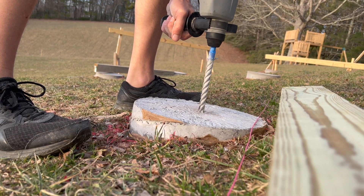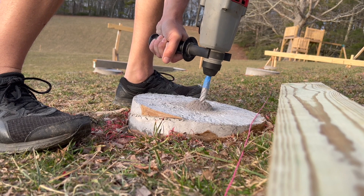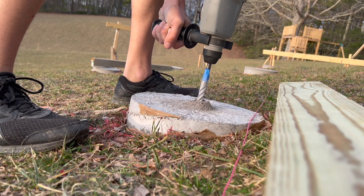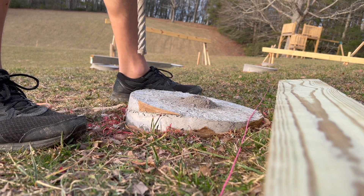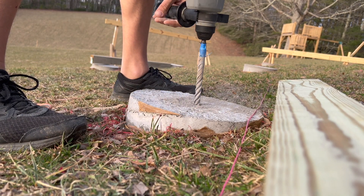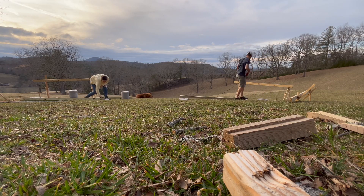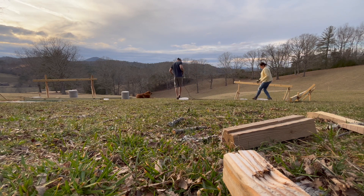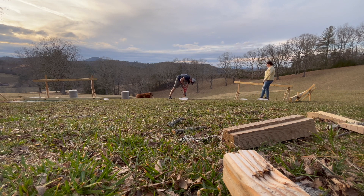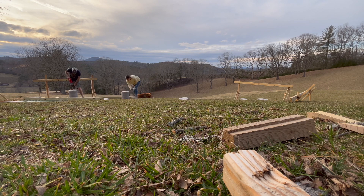Make sure you clear the hole of all the concrete dust. When you see me coming up out of the hole a few times, I'm just trying to pull that dust up — you could also do this with a shop vac. We had a funny thing happen where I came back a few days later ready to put bolts in and there was ice in my holes, so I'm glad I checked the depth because I would have driven a bolt in and it wouldn't have been to the depth it needed to be. Just make sure before you beat those big bolts in that you actually have the extra depth you need — you don't want them ending up proud.